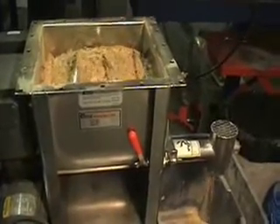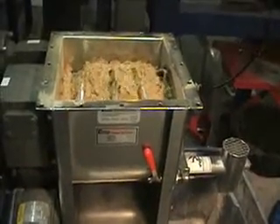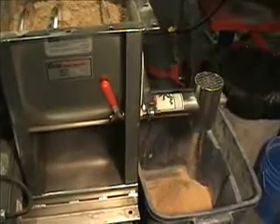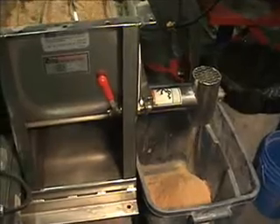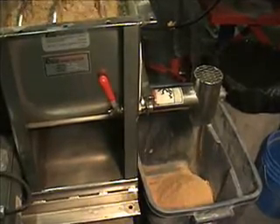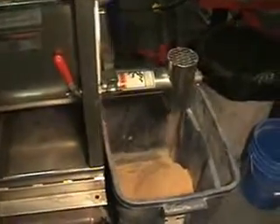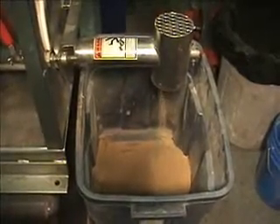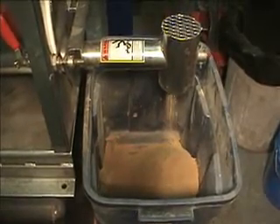This is a Thayer two inch screw feeder with hopper agitation. It has a special feed screw called a differential screw, which has an outer spiral that pulls material out and an inner spiral that basically pushes material back in. It is designed to eliminate the plopping effect at low feed rates. This feed rate is approximately one to two pounds a minute.